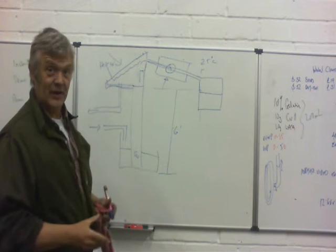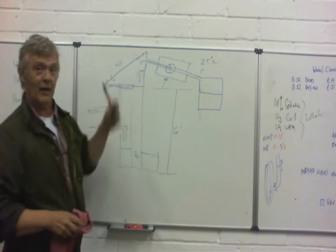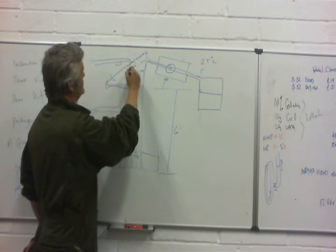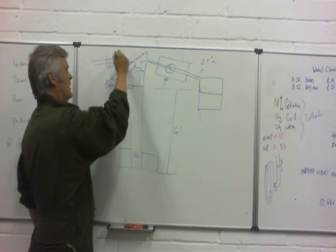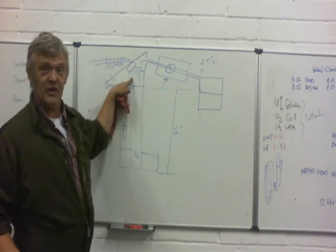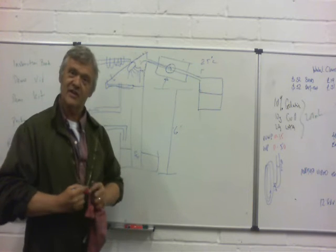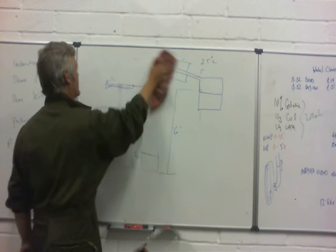There is another adaptation that would work really well. Instead of having a heater within the box, we would have our feed salt water supply coming in through a spray nozzle, spraying the salt water out. If we heat this section to around 40 to 50 degrees and it's at lower pressure, when you spray that out, it will immediately evaporate. So we've got a flash evaporation, low-temperature, low-pressure system — those are the kinds of ideas I've been playing around with on how to get this water out so that it can be used.